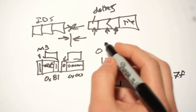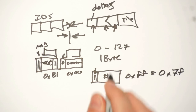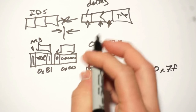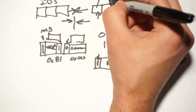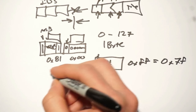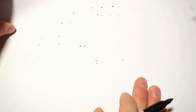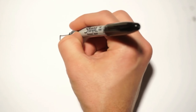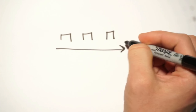So that way, instead of spending 2 bytes every single time, like we did under the normal protocol, we only have to spend 1 almost all the time. In addition to this, we can then read it from the back, and we can keep track of where we are, and then when we start popping off the IDs from the front, we will just meet in the middle. Now, the IDs from the front are their own little complicated world because there are other situations that you can run into. What if it's not this simple one LED on and one LED off kind of thing?